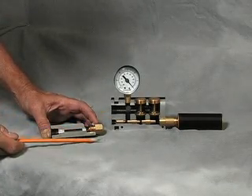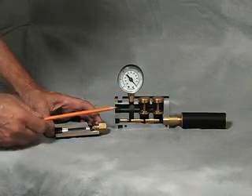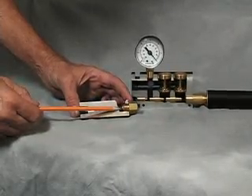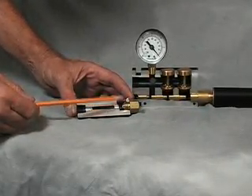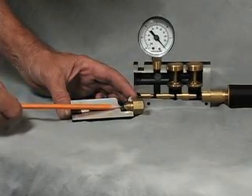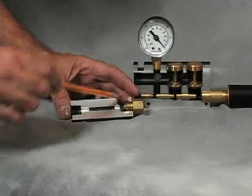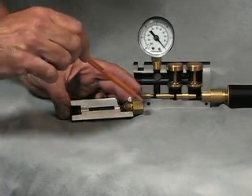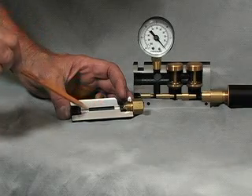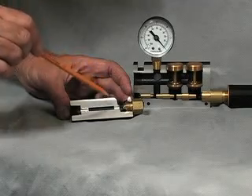What I'd like to show you today is the difference between a single venturi pump and a multi venturi pump. In the single venturi pump, we have a brass nozzle that converts compressed air into a very tight, fast-moving bead of compressed air — that's how we create the vacuum. The air comes through the brass nozzle, down through the vacuum port, and through the receiver section of the pump. There is one area here where we manufacture vacuum.